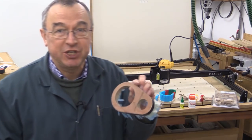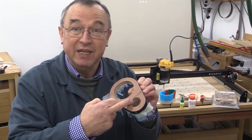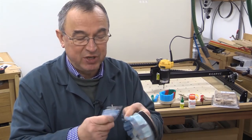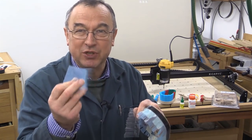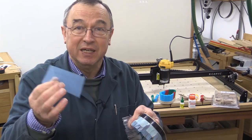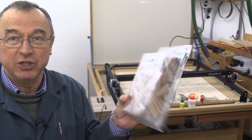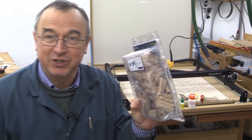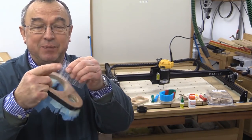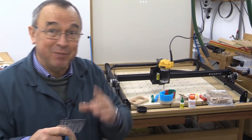And that came from a guttering downpipe — I'll put the details on the screen. This is one of my prototypes. It had the hole here for that bit of guttering pipe to fit into, and a hole for the extraction hose. This was one of the things I tried: just ordinary thick plastic, the sort of thing you'd use on a building site for a damp-proof membrane. I tried cutting it into strips and cutting it partway through to produce a hairy effect, but that didn't work very well, as I mentioned in a recent video.